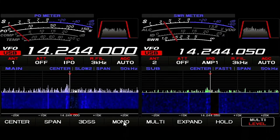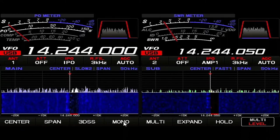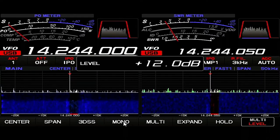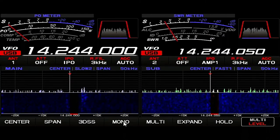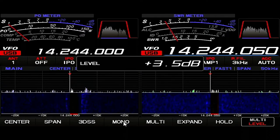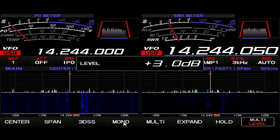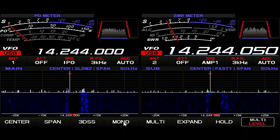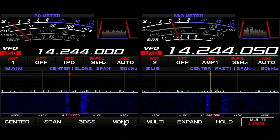I like it this way better. I just do. Okay, so on antenna one on the left is Callum McCormick's DX Commander all band vertical. Now what I'm going to do, I'm going to lower down the gain because it's just too hot because, you know, I was ready to work radio downstairs later today. So there we go. If I do want to move it over the same thing so it matches on VFOB, all I do is I press the sub receiver and then I just bring it back down. See? Goes back down just like it did on A. So now you have essentially the same waterfall showing on both ends. It's just that they have different amounts of noise coming into them because they're on different antennas. So we're just trying to bring up to about the same look in the waterfall. That's why it looks that way.